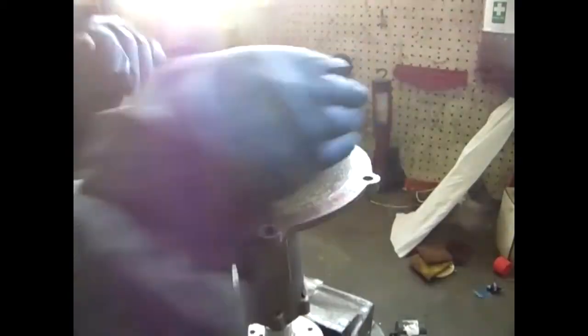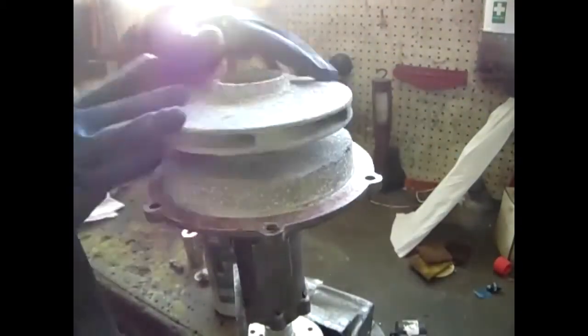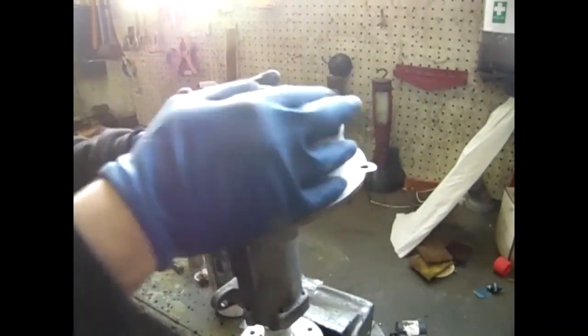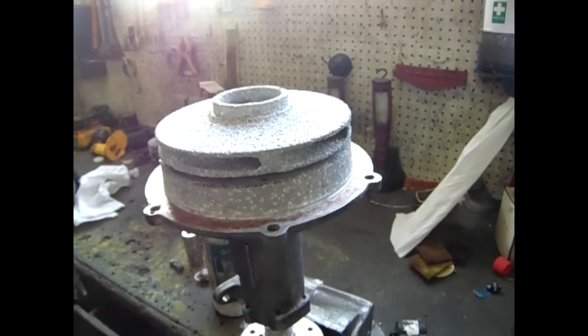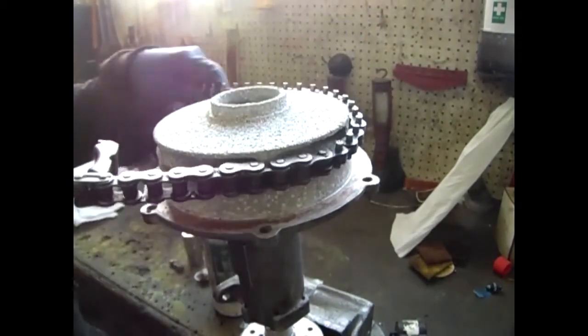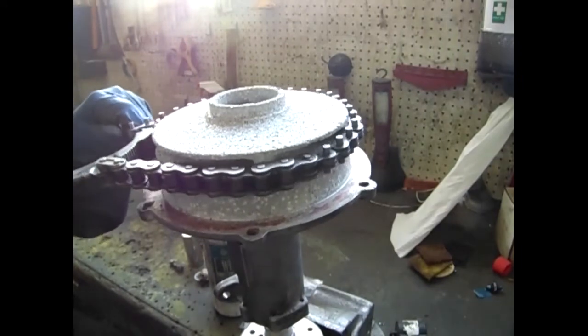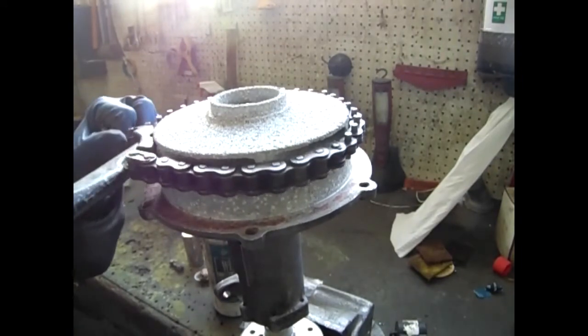Once the seals are together, place the spring onto the rotary seal. It's a good idea to apply a small amount of grease where the spring contacts the base of the impeller. You'll see a little groove where the spring will be seated, and as you spin the impeller into place, the grease will help the spring from catching as you compress the impeller down onto the shaft.